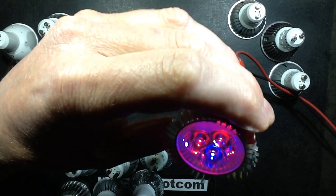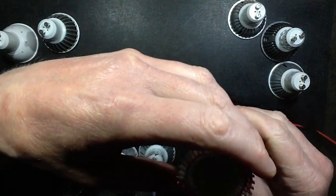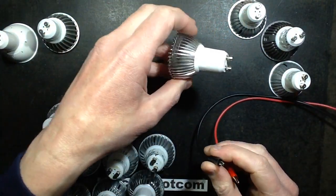It just cut out at about 5.4 volts, and it's not going to light until it gets up to about 10 volts, then it suddenly lights. That does suggest it's not just leaking through a buck regulator or something like that.